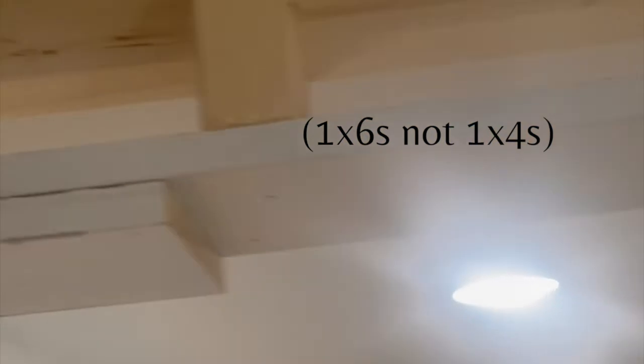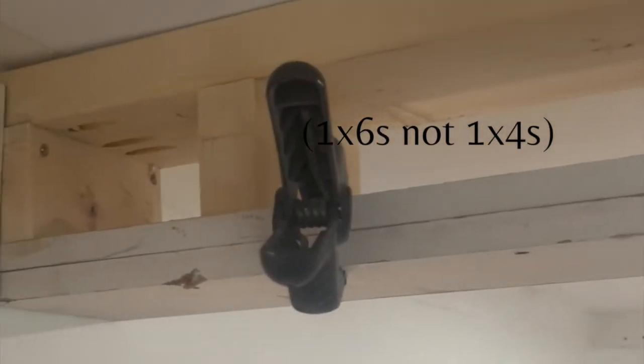Here's a little close-up of what I'm doing. I am actually offsetting these pieces so that they're not resting on the ceiling by about half an inch, and I'm going to have a lip about three-quarters of an inch, which is the exact width of one of these one-by-fours. So what I did was I have a piece clamped, and then I just make sure all of these pieces line up with the bottom of this clamped piece. This will come off, and then there'll be the exact gap that I'm looking for.